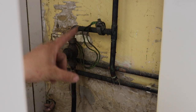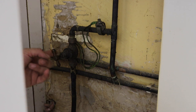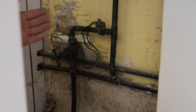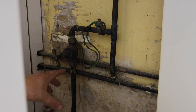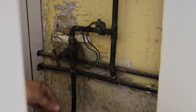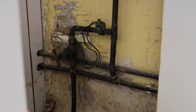Okay so now we've got the back panel removed, the base removed — which we need to sort out — and that top brace removed. The problem I've found is that this main stopcock is sticking out of the wall five inches, which is obviously going to push our dishwasher forward quite a lot. So what I want to do is just try and slacken these off and twist this round just to allow the dishwasher to go back a bit further. It's not going to go right the way back but that'll gain us another three inches.